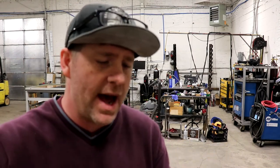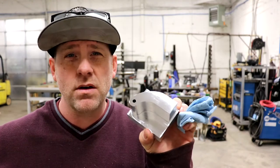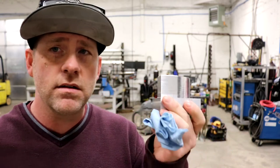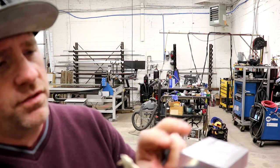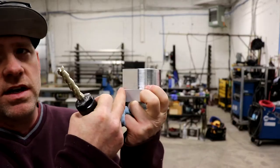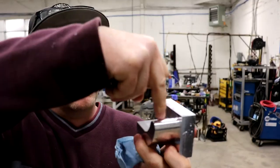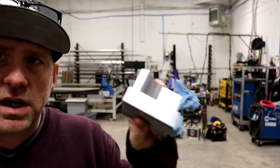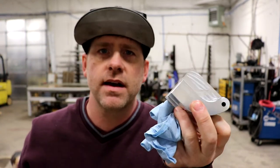I've done it a lot in the past if I can't get a perfectly smooth finish on this, but this is just a beta run. This is just a test to try and get this thing up and running. Now I gotta go on and machine the bottom half off, which actually leaves that round part down here. And then I have to machine the pocket out of here and then bore 2 holes there so that it can mount. I still got to work on my CAM for that. And when I get to that, I'll document that as well.